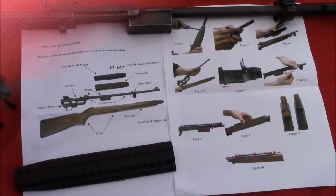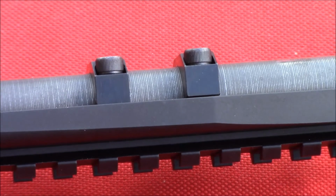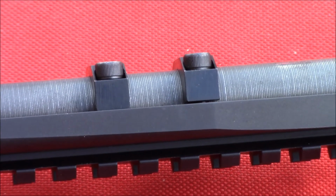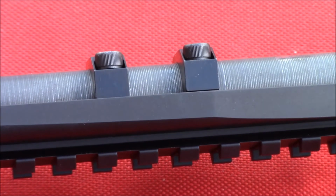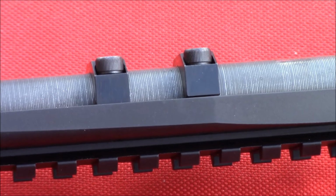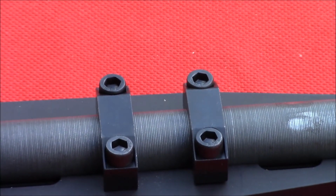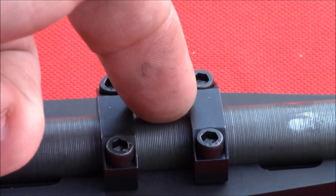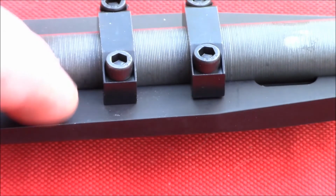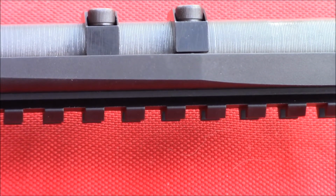They really want to make it easy for people to put it on. Points for Ultimak. A word about one of the few things you can get wrong when you try to put this together is the clamps. You get the clamps. Notice there's a little air gap under the one on the right and none on the one on the left. The one on the left is wrong and must be punished. Whenever you're clamping anything like this, you want to see approximately equal gap on both sides. On either side, the clamp is actually touching the thing being clamped at that point. It should only be touching up here. That way all the pressure is on the barrel and none is down here on this plate. You want to be putting the pressure on the barrel, not on the plate. Make sure you have equal gap on both sides.